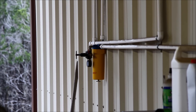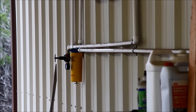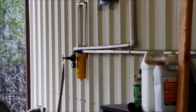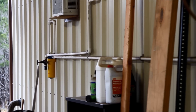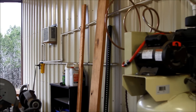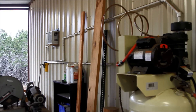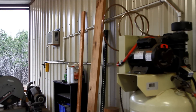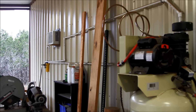If you look as I pan here, it actually has a drip loop with the PVC pipe before it goes into the shop. As it's coming out of the compressor, it actually slants down. So all the moisture, after it comes out of the tank, should run downhill and all go into that dryer. You should do that regardless of whether you build an after dryer or not — it'll help you quite a bit and keeps the moisture from just sitting in the pipe constantly.